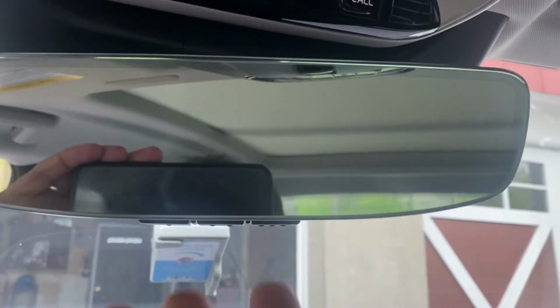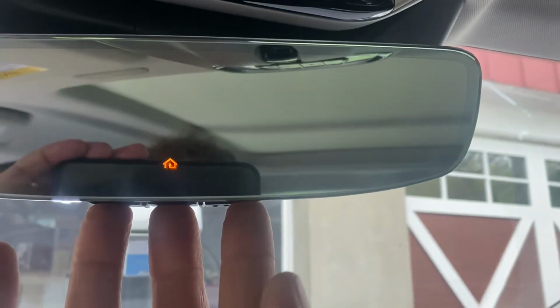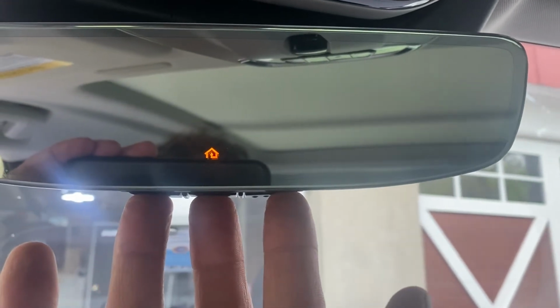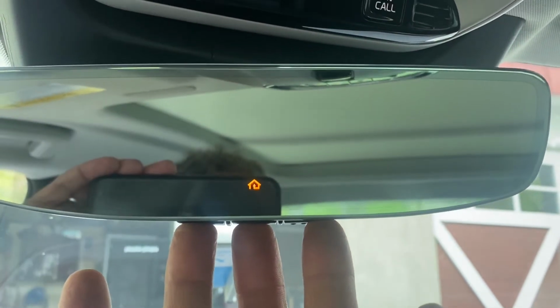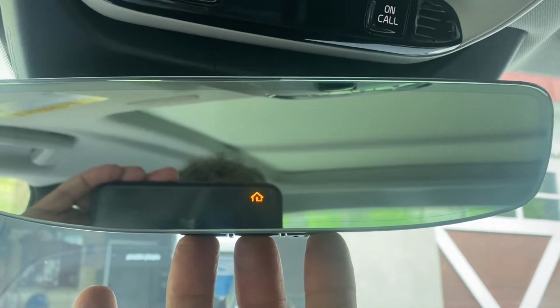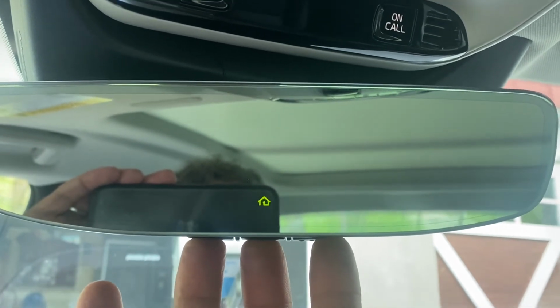Once the Homelink indicator light goes off, I press and hold all three buttons again until the Homelink indicator light goes off. And what I'm doing here is putting the car into D mode. D mode is basically a direct programming method that SOMMER uses on 310 megahertz.